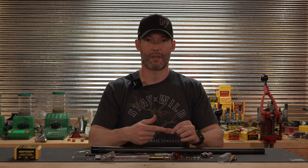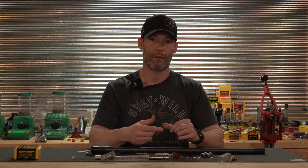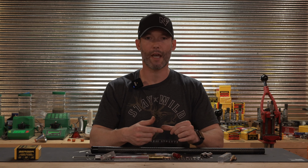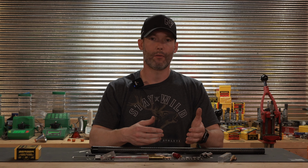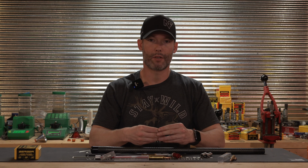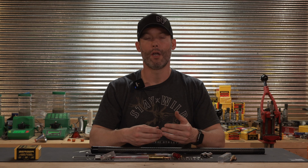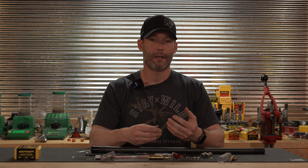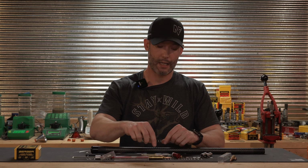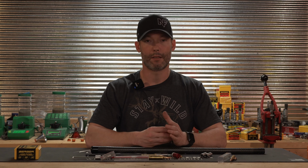One of the biggest ones is the 7mm Rem Mag. It has a very steep lead angle and has a very shallow throat, which allows the older 140 and 150 grain bullets to work very well in the chamber, but some of the newer bullets like the Berger 180 grains, or the 180 ELDMs, or the 190 Berger that we're actually throating this for, they're just stuffed down too far in the case, and it's leaving performance on the table.